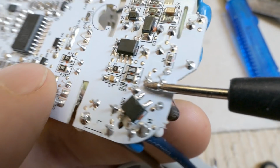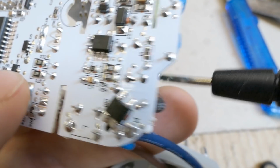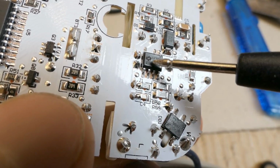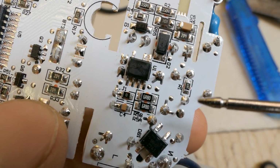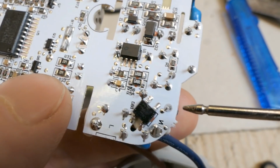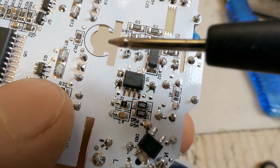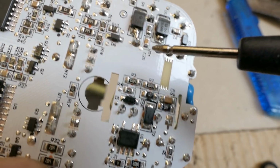It goes into one, then through this interference inductor and the other one then. There are some small components and this switching chip. Some of those resistors might be a current sensing resistor, some capacitor and a resistor probably in the snubber network together with some diode. I don't see the snubber diode. Maybe here. But there have to be another two diodes for the output.